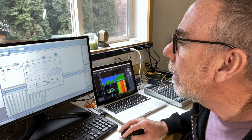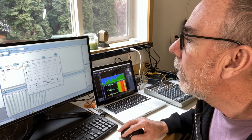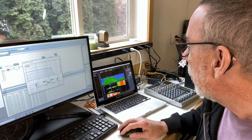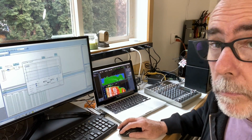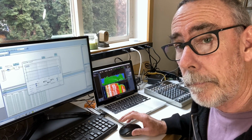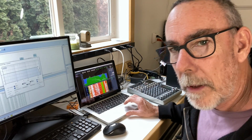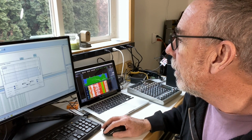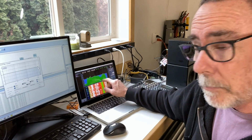All right, so from here, kick that off. Let's make sure our low frequency driver is going to get us to where we need to be. Make sure it's going to get us to 2K as well. It easily will. It's got a funky spike up around 8K, which is crazy. It is what it is. We'll filter that out. So we're going to get rid of all of this, and we want this driver to just work up to about 2K.